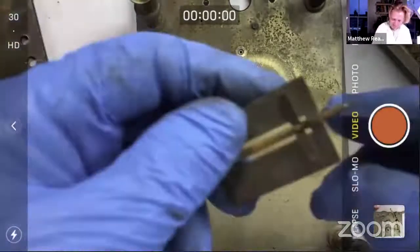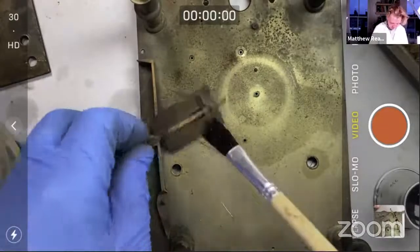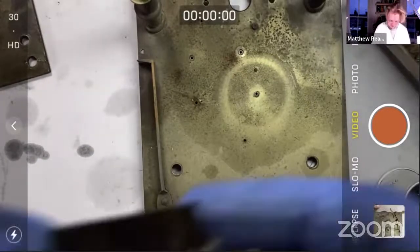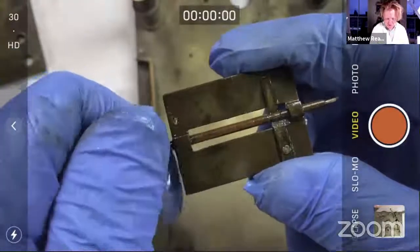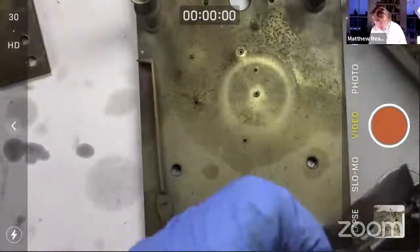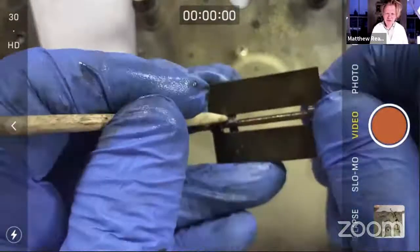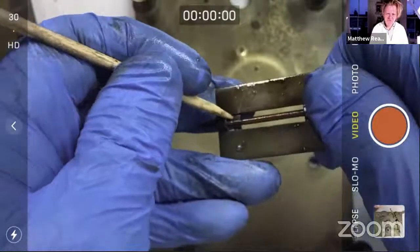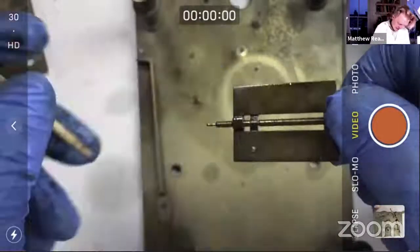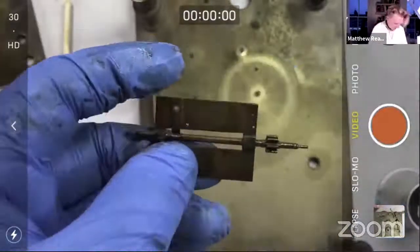As we know, our fly spring probably has to go, if we can get it out. It's been pushed around the back of the arbor there. And I think when we get the arbor out, let's just see if it'll come out now. Probably pretty brutal process pushing that round there. Let's just see if we can get the arbor out without risking breaking something. Yeah, that's slightly problematic because, let's just, tweezers.